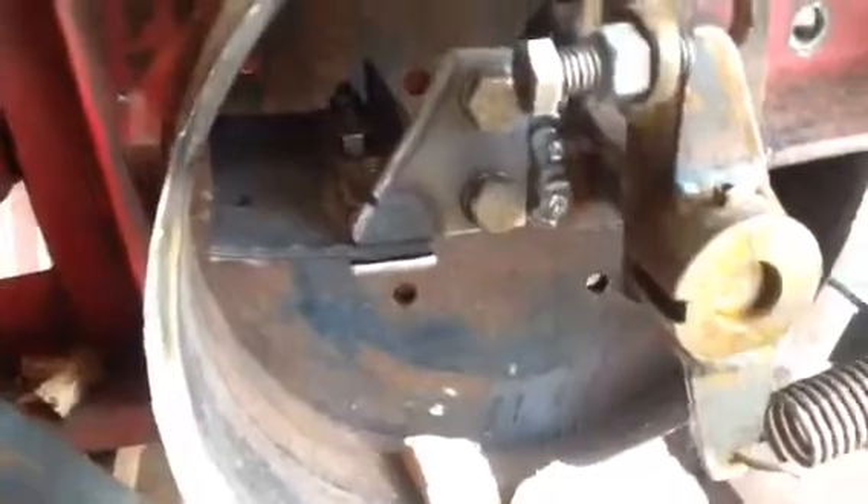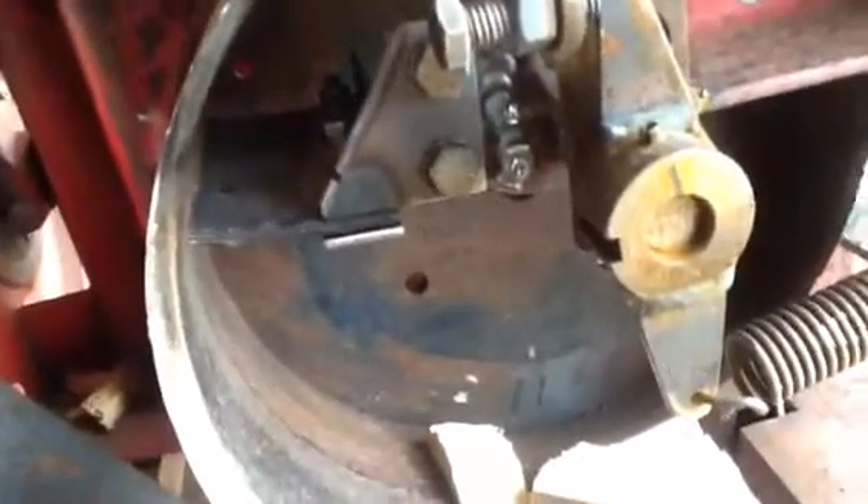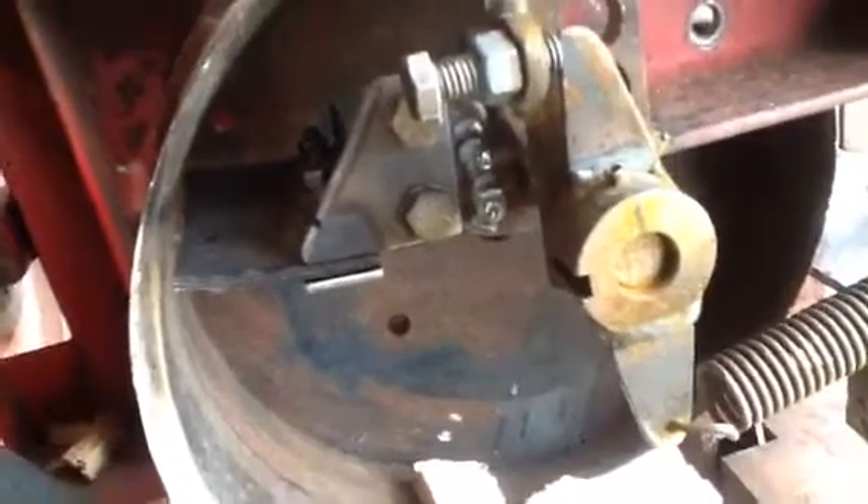Up here it's a piece of two-and-a-half by seven inch belting. It's belting because if a sliver gets in between the drum and you use metal, it might jam and want to go around and wreck the whole thing. This is the second design I did, plus many changes in between, but this seems to work quite well.